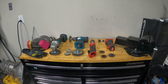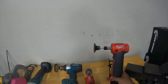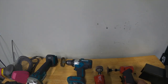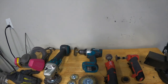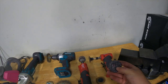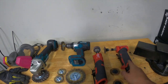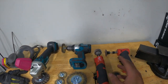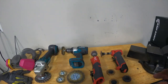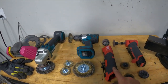Here's my toolkit for prepping the seams for stitch welding. My main tool was this die angle grinder from Milwaukee — fantastic for taking off that top layer of paint using small sanding discs as well as paint removal discs. Both worked really great. There's also a straight die grinder for slightly different, more flexible access. The angle die grinder did about 95% of the work; I rarely needed the straight one.